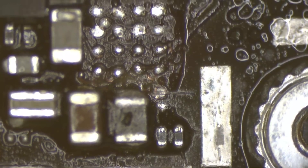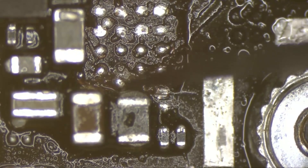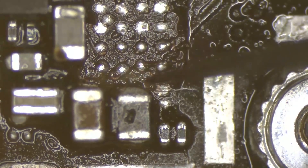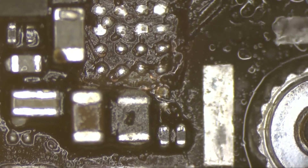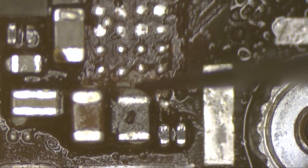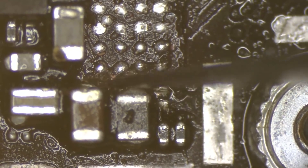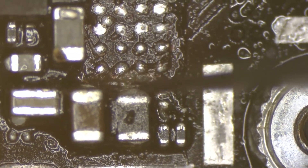Not quite sure they are fine, because the area here is like — oh my god, that's totally not fine. That guy who tried to fix this phone went too deep into the layers of the board and cut the traces inside. That's too deep.